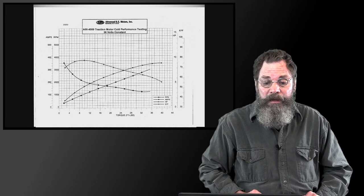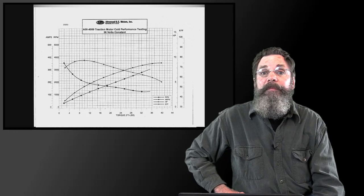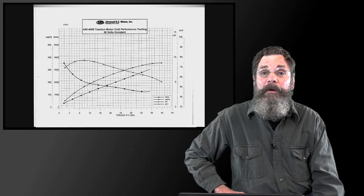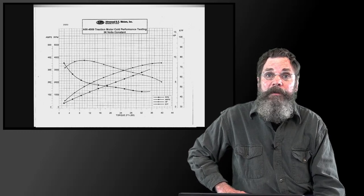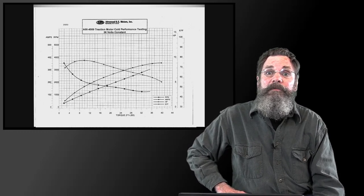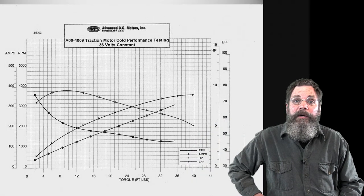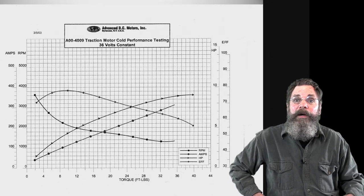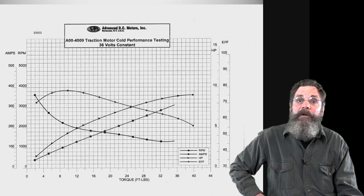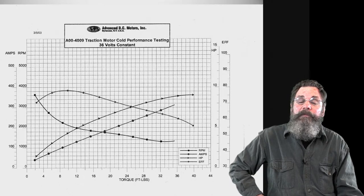And for a tractor, torque is really desirable. Now you might ask why the original tractor had 11 horsepower, or on the later models 16 horsepower, and I'm only getting away with 6.5 or 6 on this one. It's because of the torque. The series wound DC motor has an incredibly high amount of starting torque, and that does not hold true for gasoline engines. A gasoline engine has its torque generally built into a mid-range, much higher RPM area, and of course that's fuel consumption and noise and a lot of other things we don't really need.